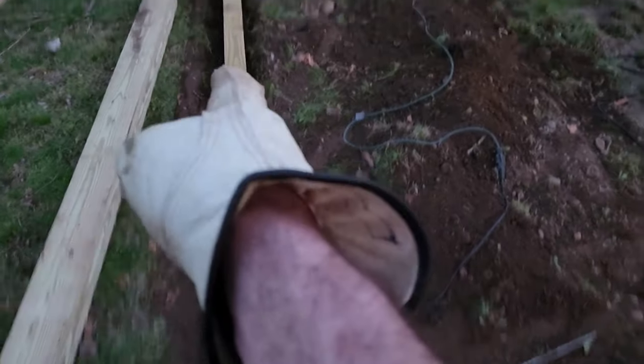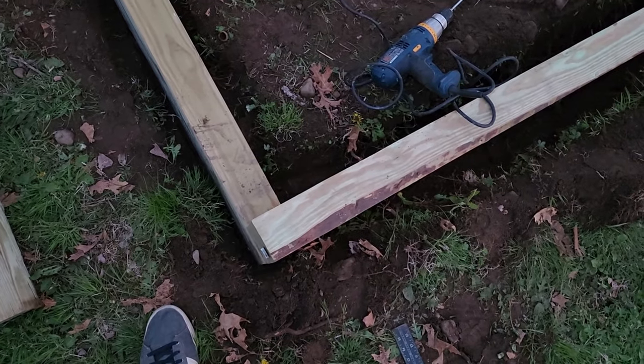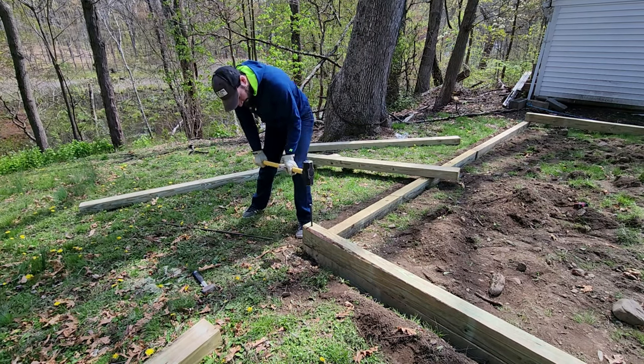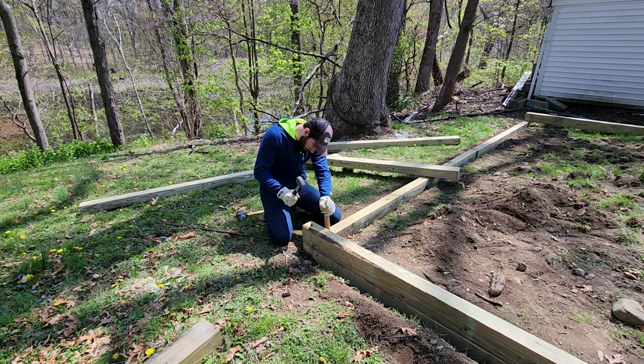That bottom part was really hard to dig. This corner is perfectly square, so I'm going to drill through here for a piece of rebar that's going to mark my starting point for all the other angles. I'm using half-inch rebar in 2-foot lengths — each red dot represents a piece of rebar. The three pieces in the middle of the back wall are 4 feet long for additional strength. I used a 1-foot quarter-inch drill bit for pilot holes, then followed up with a half-inch bit. The rebar joins the top and bottom pieces of lumber together, and at any point where two top pieces butt up against each other, I joined them with lap joints by cutting 6-inch notches in each piece and screwing them together, then driving rebar through the joint into the ground. Remember that lap joints reduce the length of your beams by 6 inches, so for an 18-foot span you'll need 18 feet and 6 inches of material.